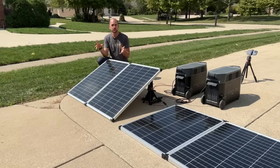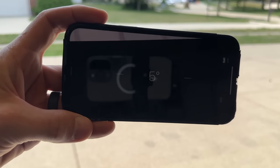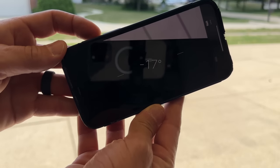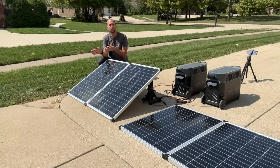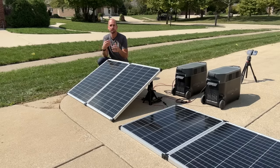If you're looking at a professionally installed grid-tied system that's most likely on your roof, you can find your roof degree angle with just your phone. Use the measurement app on your Apple or Android device — there's a bubble level feature inside that app. Lay it on the surface and it'll give you the exact slope in degrees. If you need a cross-reference, just Google 'roof pitch to degrees conversion' and you'll find a table.